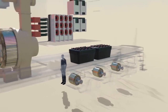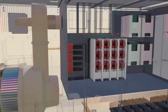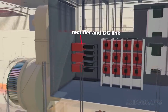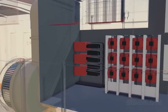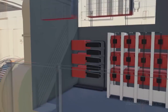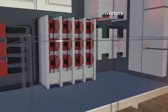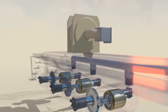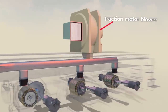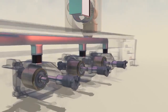A fairly intricate conversion process takes place from the alternator to the traction motors. AC power from the alternator is converted to DC power as it flows through rectifier banks in the auxiliary cab section. A DC link in the same system smooths out any uneven power from the alternator and adjusts power to the desired speed or frequency. Current then flows through inverters which convert it back to AC as it's delivered to the motors. New technology makes varying AC current more doable, and this process may change in the near future. These traction motors generate a lot of heat during operation, with a dedicated air blower system and ducting to deliver cooling air to each individual motor.